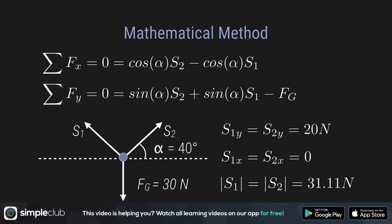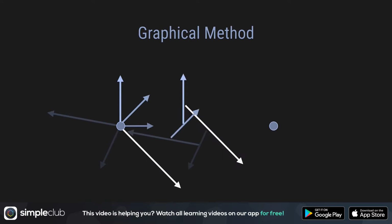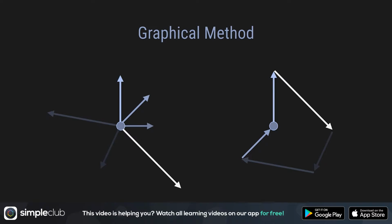For force equilibrium, the same thing applies here. The sum of all the forces has to equal 0. But how do you draw something like that? Real easy, actually. If you take all the forces in play and line them up one after the other, you should be able to get back to the beginning. For any given node, it could look like this, for example. If all the forces acting at the node are in equilibrium, then it needs to be possible to arrange the forces like the image on the right. If you end back at the same place you started, you've got an equilibrium.